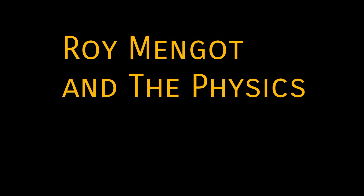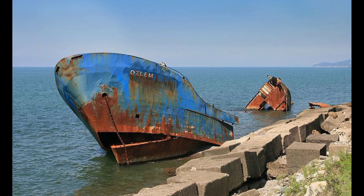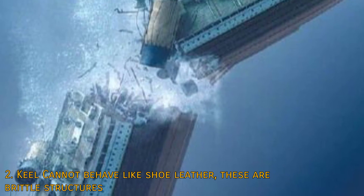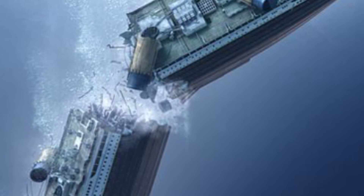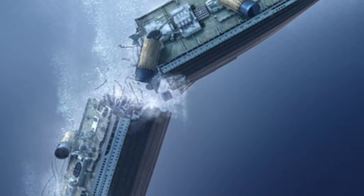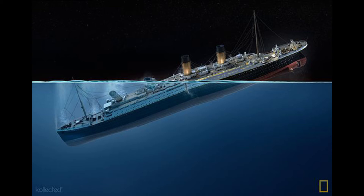The physics of the breakup process had to sink the stern. Any clean break through the ship will leave the stern floating as its own ship, or at worst, restart a flooding and sinking sequence that could take much longer than mere minutes. That didn't happen. The keel did not behave like five feet of shoe leather. The cellular double bottom is designed to be rigid and therefore was brittle. Once you've accounted for all pieces, you have to account for the forces that made them pieces. Steel doesn't just come apart — there has to be a force or major stress that breaks steel. This is where top-down breaks are weakest. Once the stress of the tipped predicament breaks the ship top-down, all the stress and energy required to break other portions of the ship are gone.